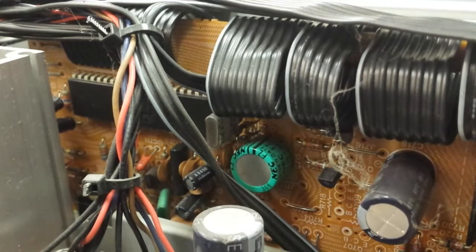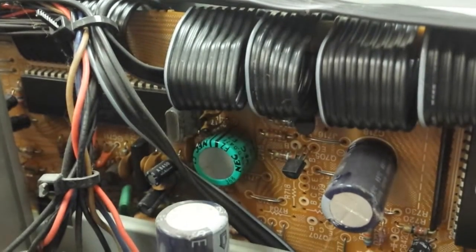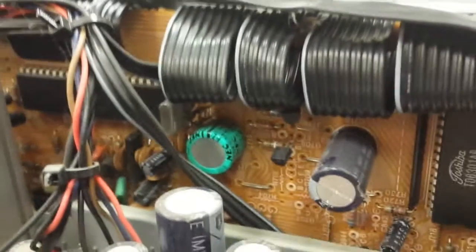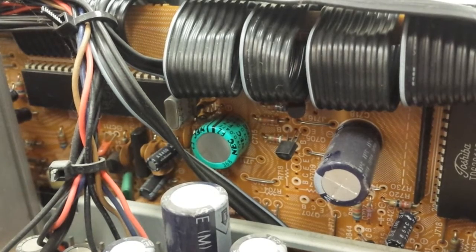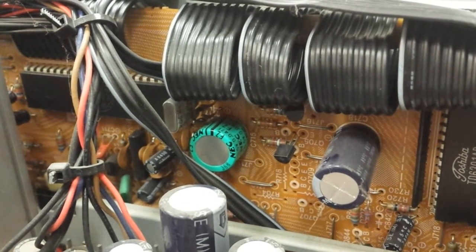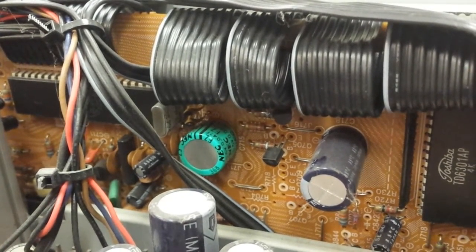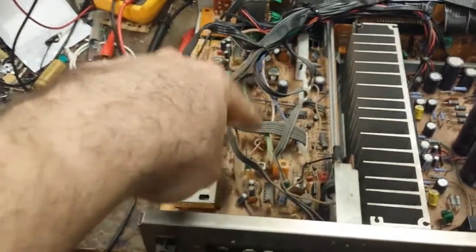Before we do that, I want to mention one more thing about early digital tuners. See that little green thing poking back there? That is a super capacitor - 0.047 farads at 5 volts. That's your memory battery; it keeps the tuner memory, presets, and all other pertinent digital display data, and it has a tendency to fail. I'm not going to replace it because it still holds memory, and it's a nightmare to take this panel off and get to it. But if you have memory problems and the unit isn't keeping presets, look for that - it's usually on the front panel tuner board or near the PLL circuit on the tuner board itself.